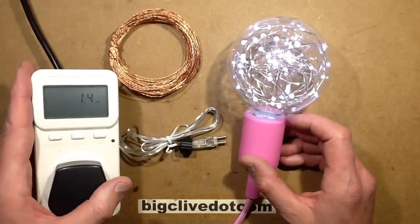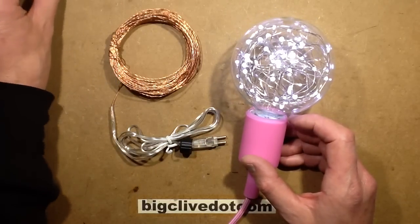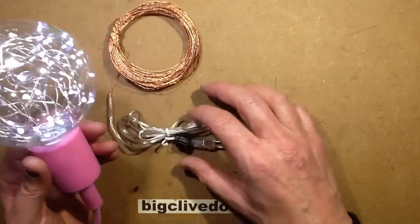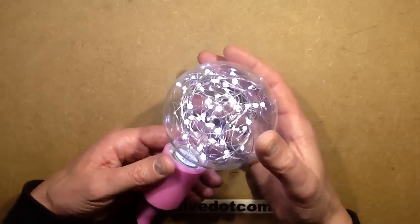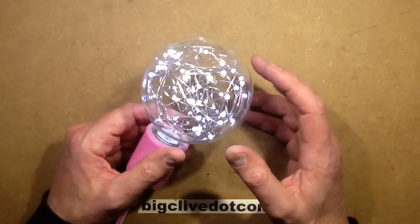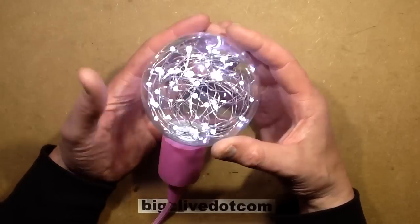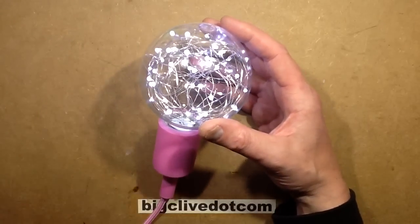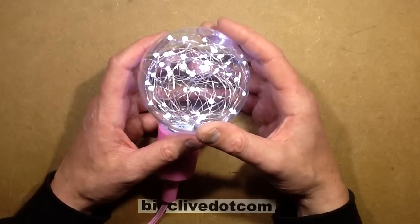I mean, this is rated 1.4 watts, it's drawing at the moment. And if you consider it, the best way to drive it, effectively, this is a string of LEDs in parallel. It's going to have a forward voltage of about 3 volts. So if you get a 1 watt LED driver, then that's going to put out about, I can't actually work that out because I'm not sure the current will be in there.